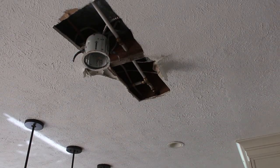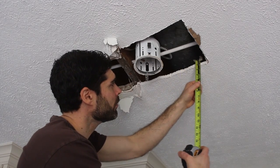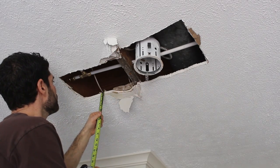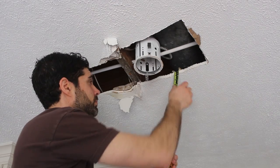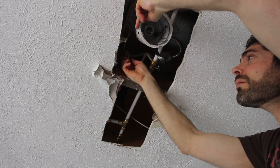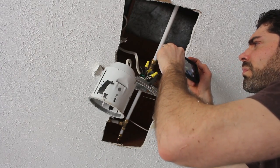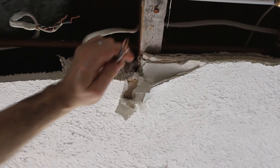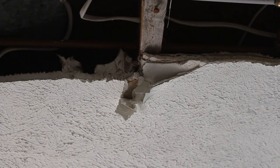This is my kitchen ceiling after the pinhole leak repair. The first thing you want to do is measure the thickness of your drywall. On the right side of the joist I have five-eighths inch, and on the left hand side I have half inch. This created a little bit of a problem for me down the road, which I'll explain a bit later. If you have a light in the ceiling, make sure you turn the electricity off to it. Take a picture of the electrical configuration before you undo it from the junction box. Remove it, cap all the lines, and stuff those lines back up into the ceiling.